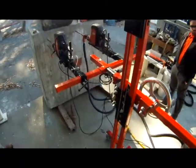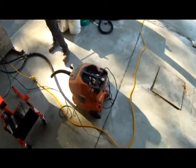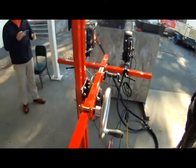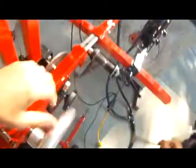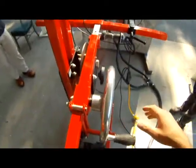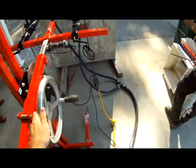It's important with the hollow bit, and you guys know this, that we have the vacuum cleaner on before drilling, or you'll ruin your bit. The vac's on, and the drills are on. I forgot I loosened that to remove it. And we're gonna have this thing in neutral. In horizontal, it's better just to leave it in neutral. Back wheels are locked, and drill a hole. And you can see that there's very little pushback from this.